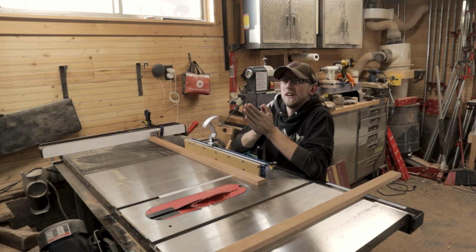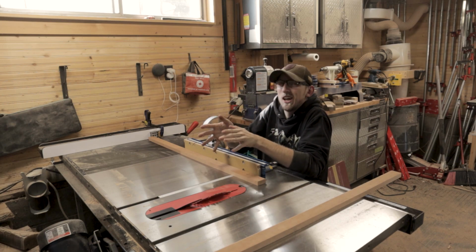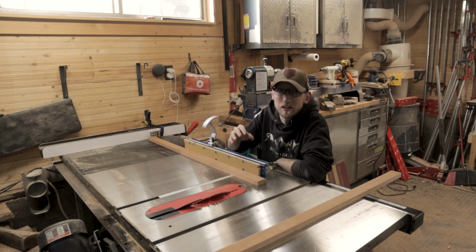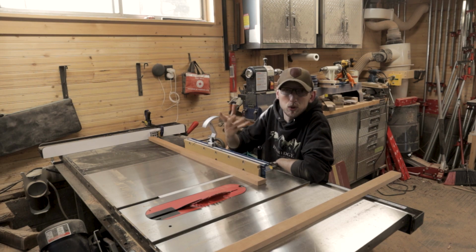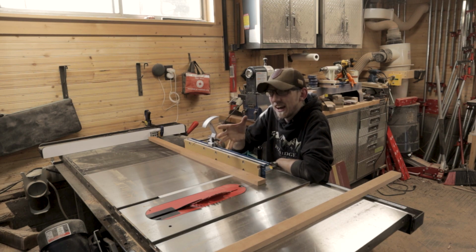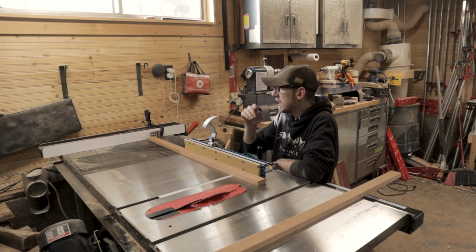Okay, so one piece of advice, if you're thinking about upgrading your table saw, get a 52-inch table, if at all possible. If you have the space for it, get the biggest possible tabletop you can possibly get for the saw that you want. For this SawStop contractor saw, I got the 36-inch fence, but you could get up to a 52-inch fence, and on pretty much every project I've done over the past year, I've hit a point where I'm like, if I just had that slightly larger saw table, there's so much more I could do,